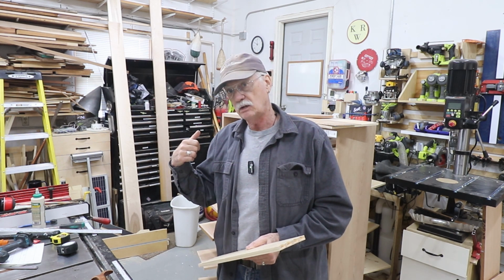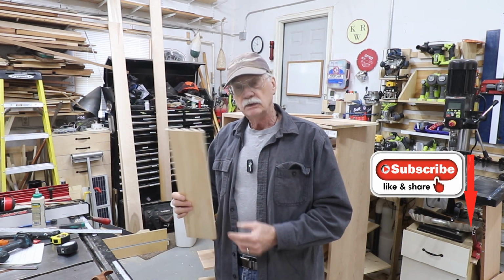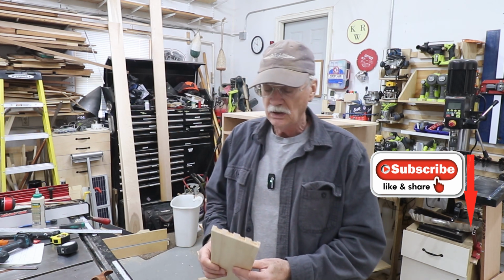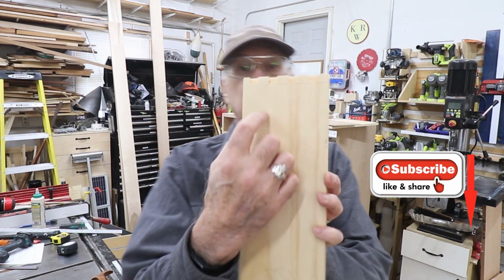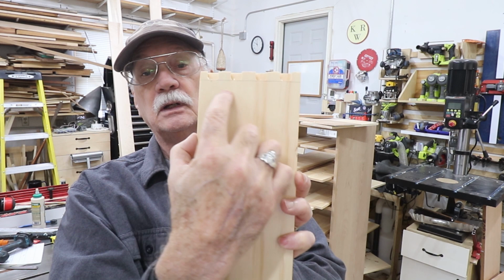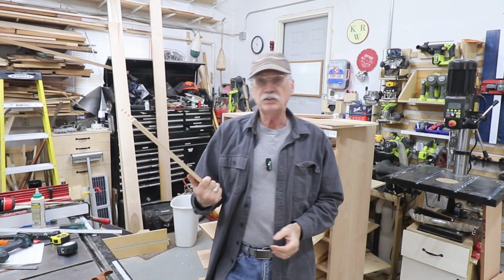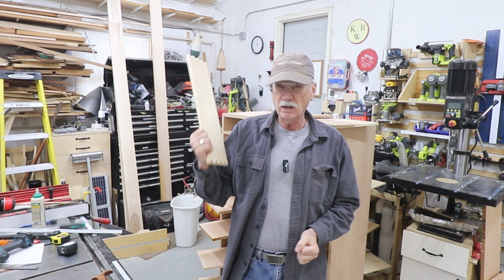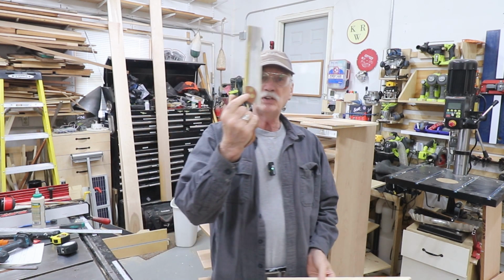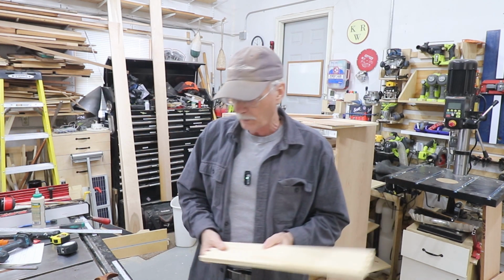Before we get started on this episode's project, which is starting to do the drawers, I want to do a little discussion on dovetails from the period. I want you to see this line that I've drawn across these. Now these are cut by machine, that's why they've got the radius there, but that line across there, you see that? When you watch people cut half-blind dovetails or rabbet half-blind dovetails, you'll note that they almost never violate that line. So when they're going at it with their dovetail saw, they'll saw those down to where that line is and chop the rest out with a chisel.